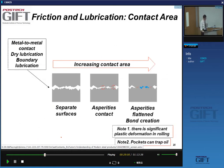Because sometimes, certainly if you're in research, once in a while you'll have to deal with technical problems, yes? And you get something that's cracked, yes? And then you quickly analyze this and you say, I found it, it's just too much sulfur in the, yes? And it may not have anything to do with the problem. It's just the residue of the lubricant. So always be very careful when doing your analysis or coming to conclusions.